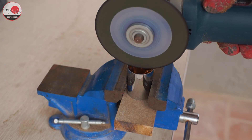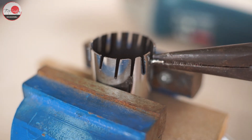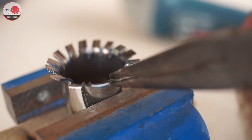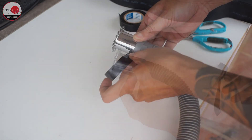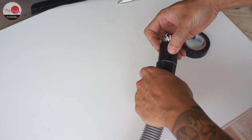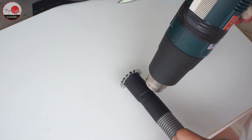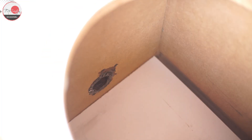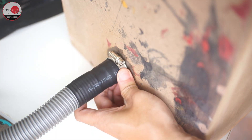Here is how I prepare the vacuum hose to connect the two chambers. I use a dust collection hose, which can be easily purchased online, together with one metal tube that usually comes with the vacuum hose. I bend one end of the metal tube to help keep it attached to the main vacuum chamber body, then attach the tube to the dust collection hose using electrical tape. I use heat shrink tubing to completely seal this connection. The metal tube is then glued to the vacuum chamber using two-component epoxy adhesive, and on the other side I use a hose clamp to tighten and fix the tube completely.